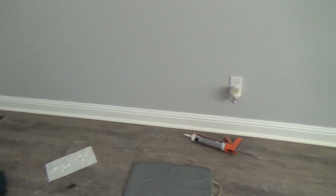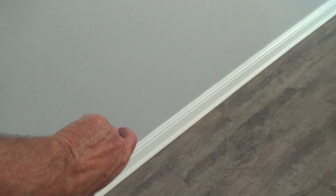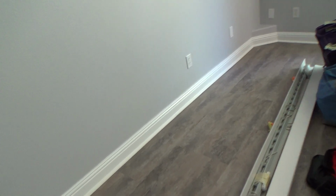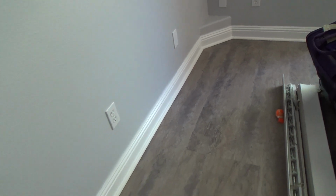And if you had, speaking of nails, because this quarter round is so small, I mean, we use 5/8 quarter round instead of 3/4 inch, okay? But can you imagine trying to get your brad nail gun down there exactly where you need to go, especially if your baseboard is above your flooring by 1/4 inch? You've got 3/8 of an inch from the top of your quarter round to the bottom of your baseboard. So you've got to raise it up, and you're barely hitting that. You could have a tendency to split the top of your quarter round off.